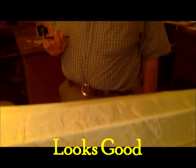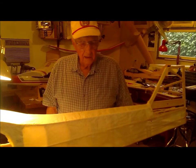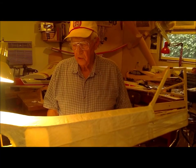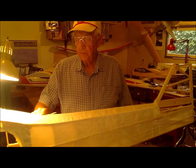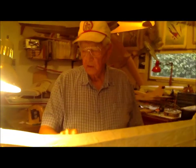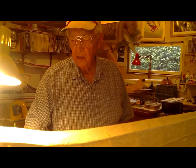That's the procedure for covering a Piper Cub J3 — the same method you use for the full-scale, and almost the same type of covering. It's a SIG Coverall, a rayon synthetic mix of fabrics.